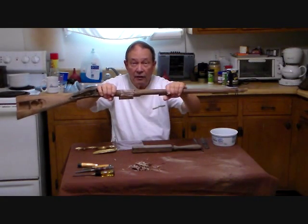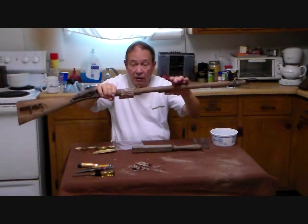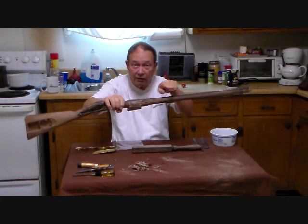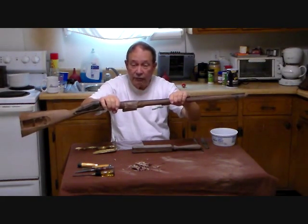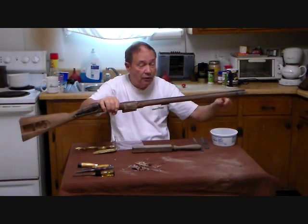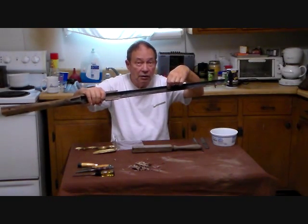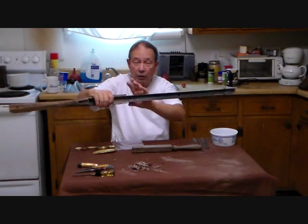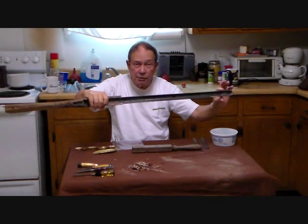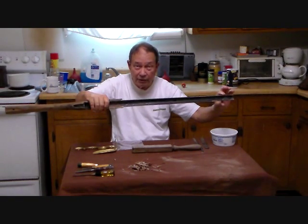Now here we used a drill, and thank God for this block, by the way. We were able to go straight through, zip, zip, zip, and then a router, zip, zip, and we opened the hole that we can put the barrel wedge through. And this is all I'm going to do. You could put in one more here, but I'm not going to bother with it. A support here by a barrel wedge and a support here, and with the rest of it glass bedded, this barrel's not going anywhere. So it'll be plenty well supported as it is.